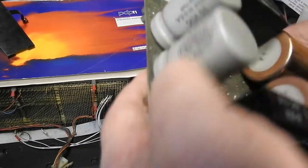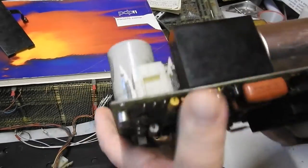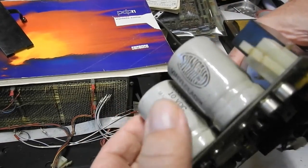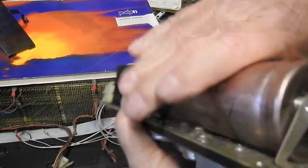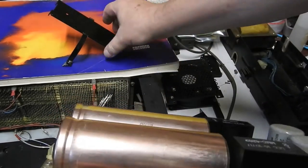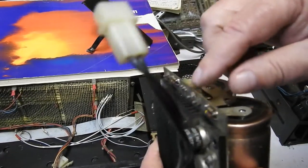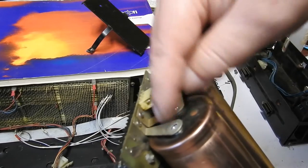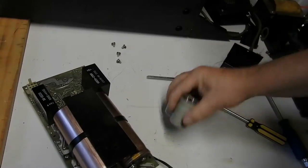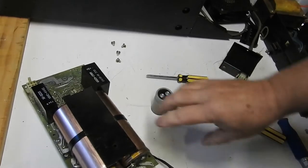I should take note of polarities. I can't see any plus and minus markings on these — maybe some will be on the top as well. The one with the five volts has its writing going there, 10 volts on that side. I've taken out the terminal bolts, but they're stuck down. Rather than breaking whatever seal that is, I think I'll restore this cover and disconnect these strips that connect to the circuit board — just undo those bolts there so I can get to the terminals without breaking the seal.